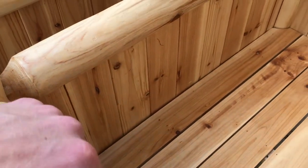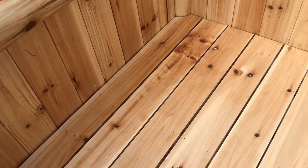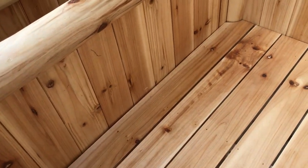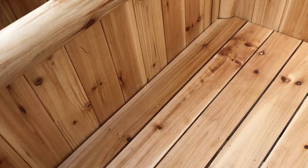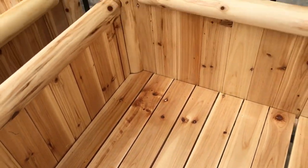The shellac feels like it will be more waterproof, but since it's just on the surface, it may break down a little more over time. The tung oil doesn't feel as waterproof, but since it's soaked into the wood, I feel like it will last quite a while. Now let's get some water and show you how each one beads up.